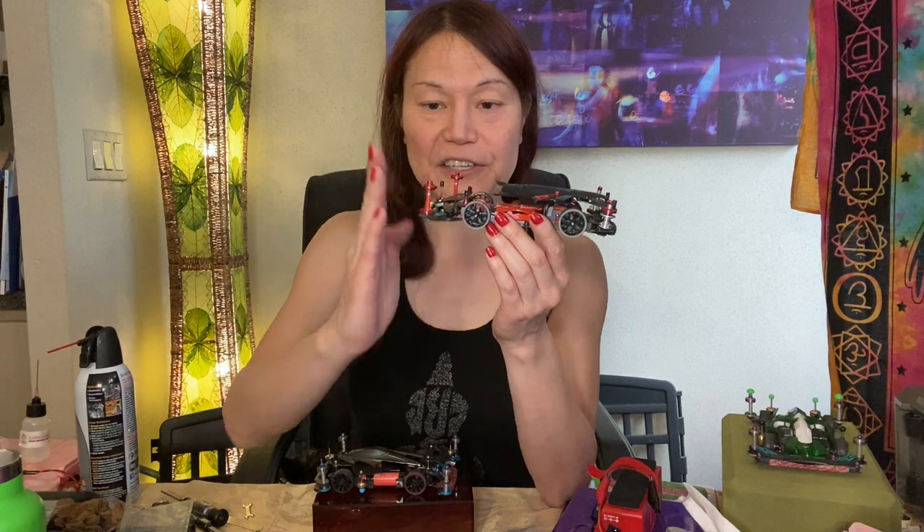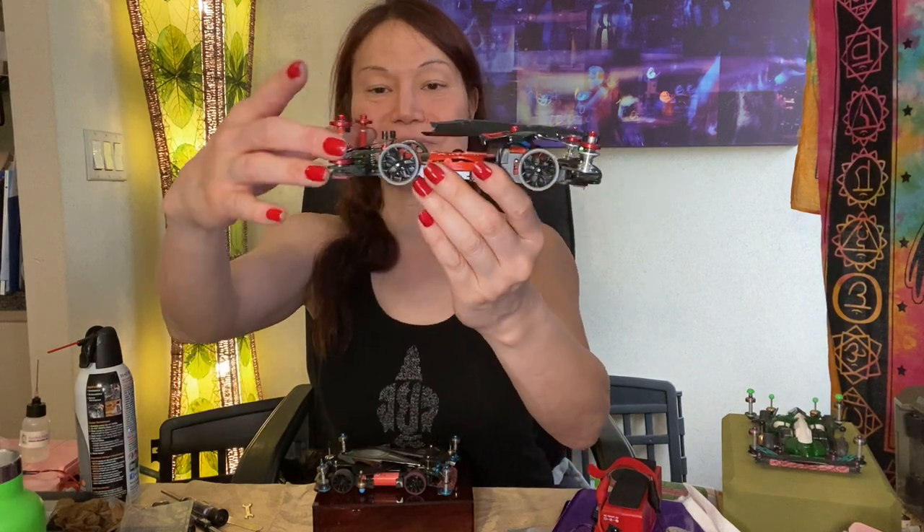You might say to yourself, you already have a tail damper — why do you need these two little mini weight dampers? Well, the design of my pivoting system is such that if I didn't have these weights, there might be a tendency for this to rock forward. So this is added insurance that the whole pivoting system stays level, so that these posts are perpendicular to the track.